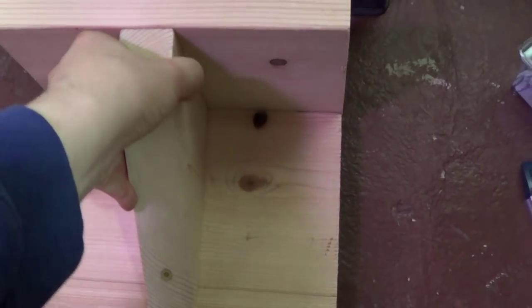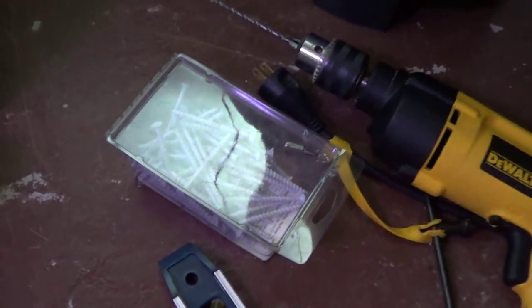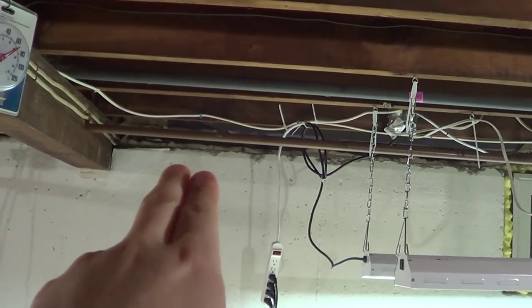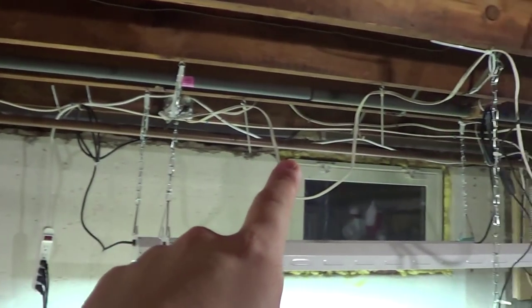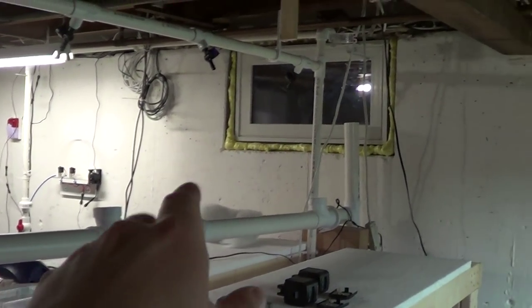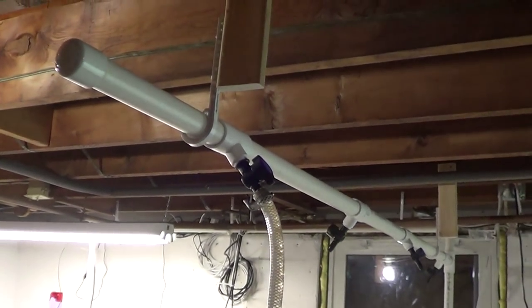As you can see, I have a little bit of a wooden stand constructed. That is going to go up on the wall right around there, and the pump is going to be securely attached to that. I have the Tapcon screws here, and those will go right into the concrete wall and hold all of that up just fine. I'm going to run the three-quarter-inch PVC tube in both directions — over here, and also that way to get to my central filtration system, and then straight across the top of all these tanks right alongside the one-inch water line.